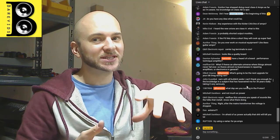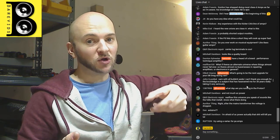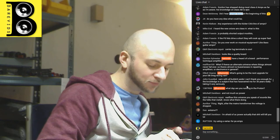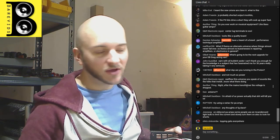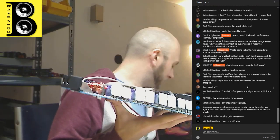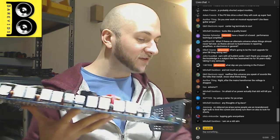So the phone sends the file over USB to the Topping D10. The Topping D10 then converts that file into optical. It's not compressing it or changing it to analog, it's just making it optical. Then I'm going optical out from the Topping D10 into the Zapco processor, and only the processor is converting the raw digital information into analog audio ready to be processed. Well, actually, the DSP will process the audio in data form first, I think. So the only digital to analog converter in the Proton build is going to be in the DSP, and it's going to happen one time. We're not converting from analog to digital, back to analog again, through various different processors and head units. It's just going from digital to analog one time as the final step before the amplifier.